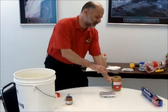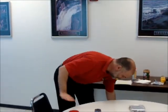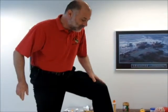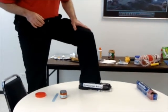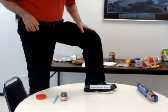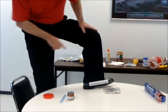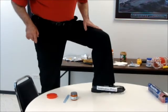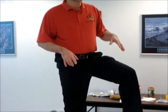Now, you know what's next? I've got to break out the lamination press again. High temperature, high pressure, sometimes under vacuum. I've got to get these layers to bond in the building of the multilayer. My lamination press is doing that. You can see I've got some squeeze-out, which is very typical. Fortunately it's not the circuits coming out — it's the resin, and that gets trimmed off later. After the resin is cured in my lamination press, I'm ready for subsequent processing.